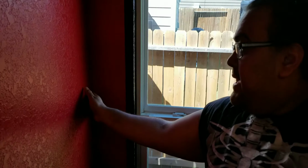Cut them to size, but at the corners, you gotta cut them at a 45-degree angle, which alone in itself is very difficult, okay? Now, this is the mistake I made. I slid the board all the way flush to the wall, and when I went to put this one, it wasn't fitting. It took me a while to realize they're supposed to meet together at the corner, and one's not supposed to be flush in the corner. So, something to figure out.